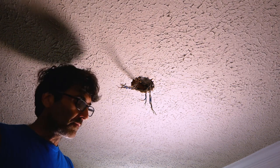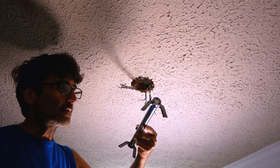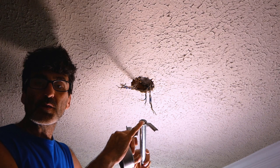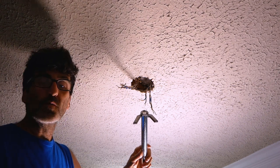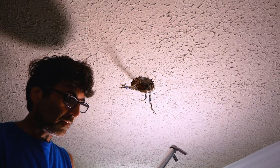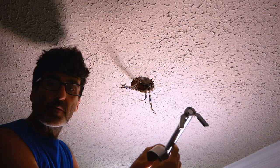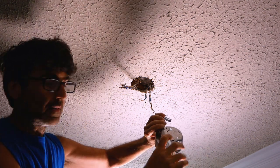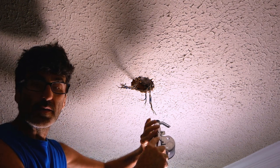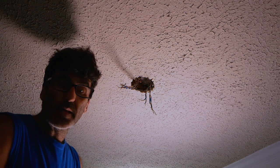What I'm going to put in place of the original box is this ceiling fan bracket. It goes between the joists — you unscrew it and it expands so you can tighten it up, and these fingers on the end dig into the wood. The box mounts to it with a horseshoe around the top, which gives it quite a bit of stability. This one is rated for about 70 pounds, so I don't see too many fans weighing more than that.